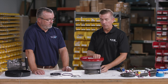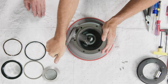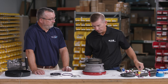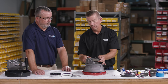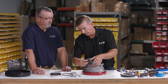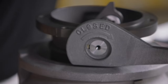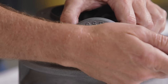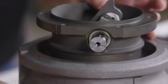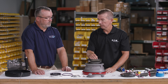With the nose seal removed, flip the coupler back over and close it. Now remove the operating handle using a seven-sixteenths wrench. Remove the operating handle from the crankshaft, then remove the woodruff key, and now we can start removing the linkage and cam.